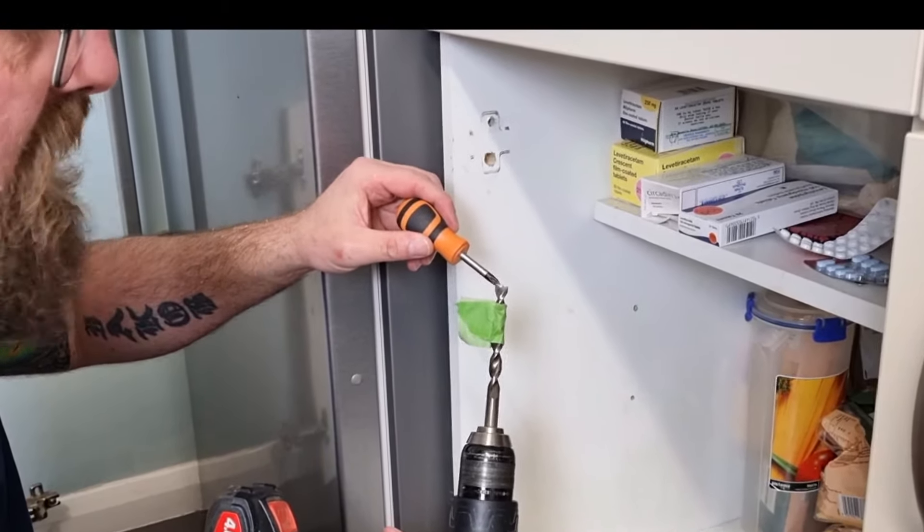These are pretty difficult to get absolutely bang on, so I wouldn't beat yourself up too much if you can't get it perfect — but getting it pretty good is fine. There's a nice tight gap along the top now, and if you look down here you can see we've got a big gap, so I think what we need to do is bring the bottom of this cabinet door slightly this way — that's going to be this inside screw here. I'll do the opposite one as well. That's a lot better already. I hope you found that video useful — if you did, please like and subscribe for more DIY and woodworking videos. Thanks to all our Patreon supporters and channel members, and we'll catch you on the next video — bye bye.